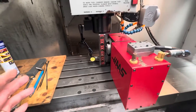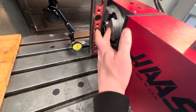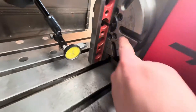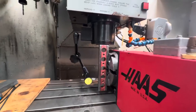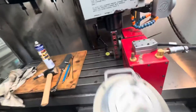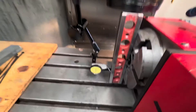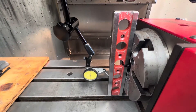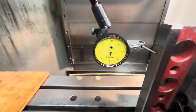I've run out of hands here. So I've got one of my parallels — a good parallel — and I've cable tied it, pulled it really tight, as hard as I can. I stoned the face of this as well. It's a bit pitted, this table, but I stoned the face of it so it's as good as it's ever going to be. Then I cable tied it through and put it on a bit of bar at the back, because I didn't have enough hands to hold this and do everything. In X, you can see we're at zero — we're actually just off, but we're not going to argue about that. I'm just trying to hold this in my hand and film at the same time. I can jog up on this parallel and show you that we're still good.